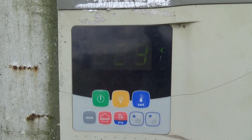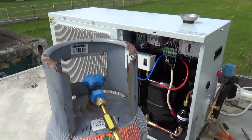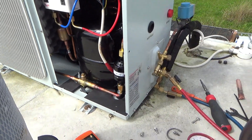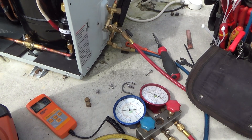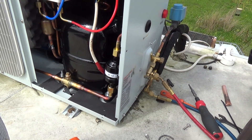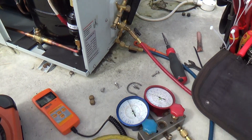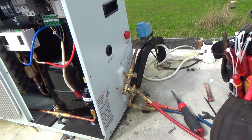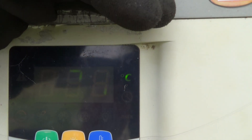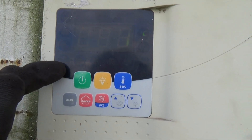That's lit up. The fan's running inside. Okay, that's just started up. I think the fan's on a speed control so that started up slowly. Let's just pump down. Possibly not got enough gas in it yet. We've only got almost 800 grams in there so far. That's the LP cut back in — it's on a three minute time delay I think. It's at 21 degrees. Fan, compressor. I've just shut the doors on it, let's see how it goes.